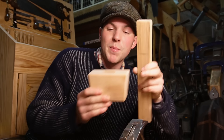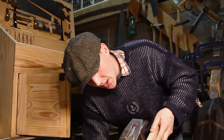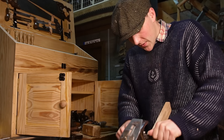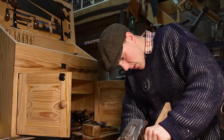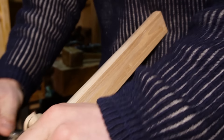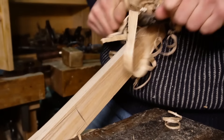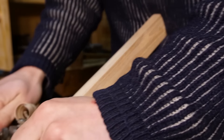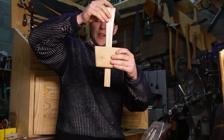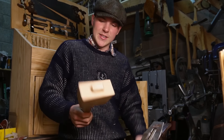In order for the handle to fit it needs to match the taper — basically the mortise is wider on top than it is on the bottom so it should just slot into place. To get that taper on the handle I'm just going to throw it into the vise, grab my spokeshave and just work my way along like this. Right, so moment of truth — we have the thing tapered and we're just going to drop it in like that and see how far we can bring it with our hands before getting the mallet and just locking it into place.